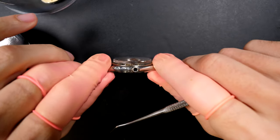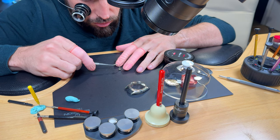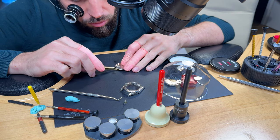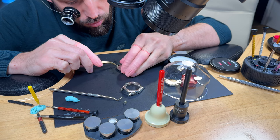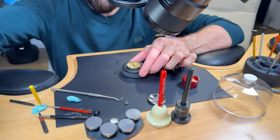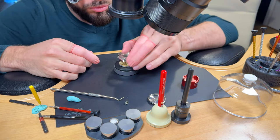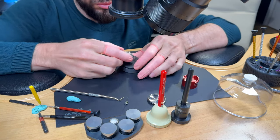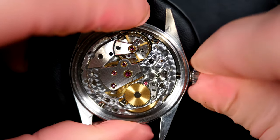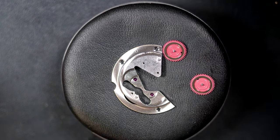Pressing the new tube gasket inside — nicely in place. Pressing the crown gasket all the way to the bottom. Last one goes on the case back. Using my new vacuum tool to remove any dust inside the crystal and blowing air on the dial to remove any particles before recasing. Putting the movement back in the case, reinstalling the crown and winding stem, and screwing the movement screw to keep the caliber secure.